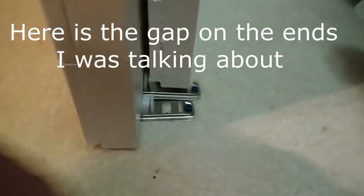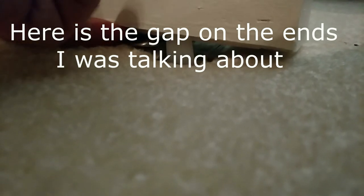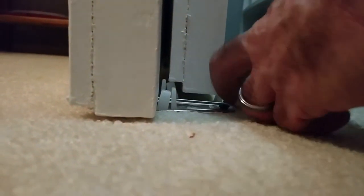On the bottom of the doors, because of the increased width, I simply used a second floor guide rail — bought another kit and ran it out. That's how I track the door. There's actually a groove underneath: by having a gap at the bottom, the board goes into it and lets the door slide while still staying trapped. You can see that gap there — and on top, there's your track mechanism. I added a second track as well.